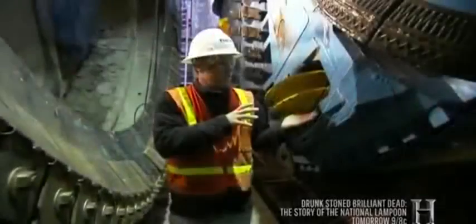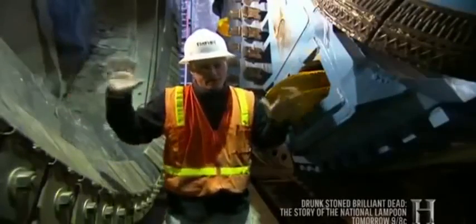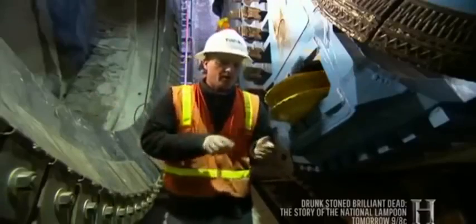Basically, the machine will thrust off the tunnel lining and mine 5 feet, retract jacks in certain locations and start building that ring in the space that we just created. So basically, we push, mine, and then we build a ring, and push, mine, build a ring.